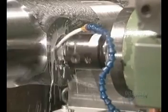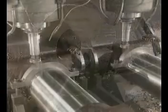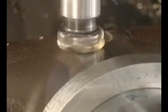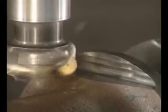Here, they complete an attachment hole. The hole is enlarged on its sides as required by this machine tool. The part is cooled with a mix of water and oil. Cutting is completed and the hole is now cleaned out with compressed air so that they can proceed with a visual inspection. Here, 3 pieces are rough cut at the same time by this machine.